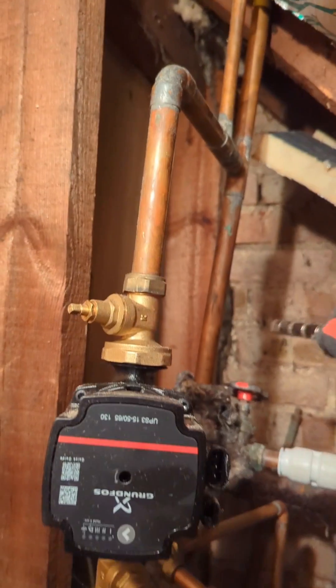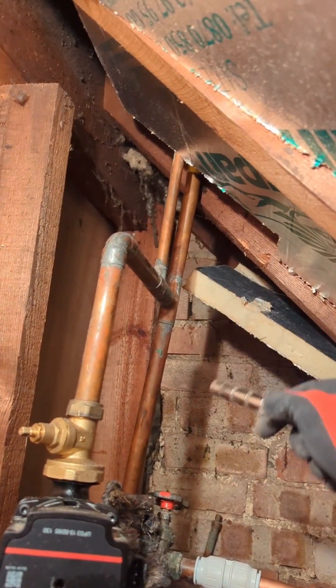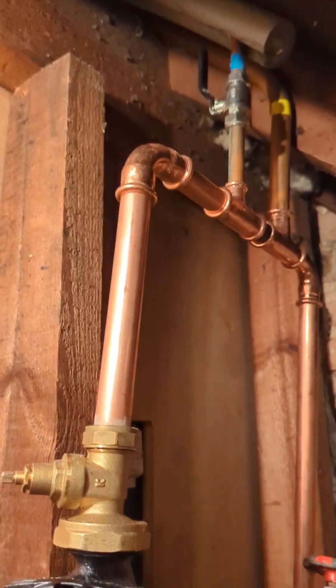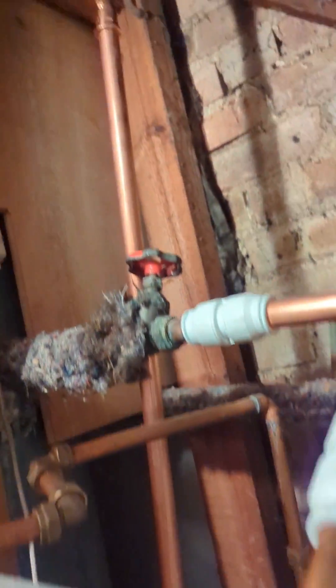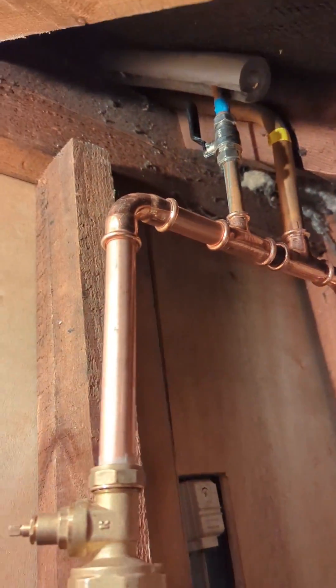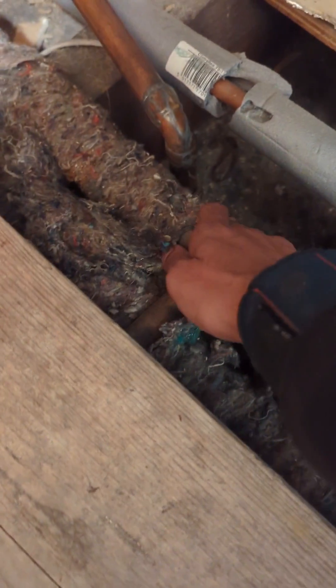So this needs to be cut up and re-piped. I have re-piped that heat section, put a lever valve up there, taken that down to there. There was a compression coupling there, so I just put a compression elbow on there, brought that up, and redone that heat section.